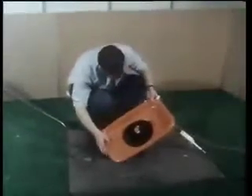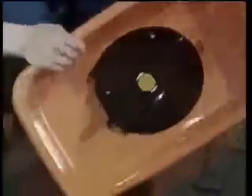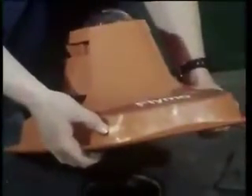This is the result of the test. On the inside edge of the hood, you can see the indentations produced by the impact from the ball bearings. There's also quite a lot of damage to the metal blade of the impeller. On the outside edge of the hood, you can see a phenomenon known as strain whitening, which is produced by a ductile response of the ABS.